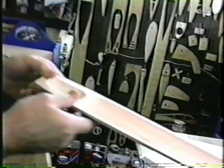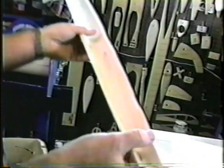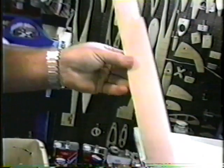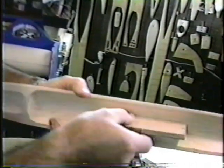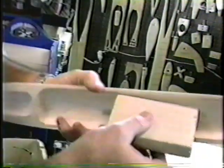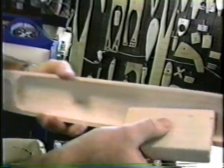Now this is a top block that I'm working on right now. And you can see how hollow it is. Kind of sanded inside. I have the turtle deck carved right in there. And again, what's real handy now, some of these sanding blocks that have the edge, I can get in here with this motion. Okay, the one with the real big curve, I can get in here and kind of hollow this out with 80 grit, 70 grit.